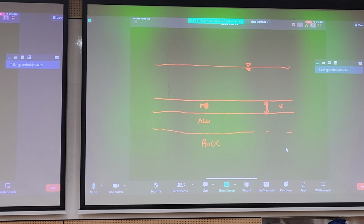You can fill this with, let's say, dump sand on here. You can dump sand all the way here. It can be some fill material, but if you dump sand on here, what happens? Well, this MD layer will compress. The fill layer can be what you assume as the surcharge or total stress applied to it. And when the MD layer compresses, well, your fill layer will also settle, right?